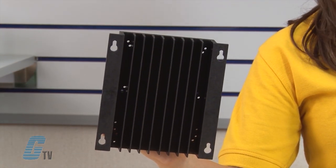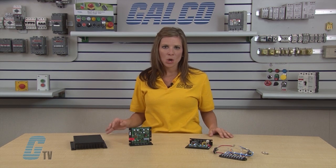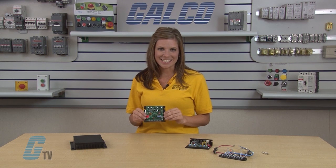Additional versatility is achieved by using the auxiliary heat sink, which is used to double the horsepower rating of each model. The output of the control is a linear function of potentiometer rotation. Motors that require larger amounts of horsepower would also require the heat sink accessory to prevent the drive from overheating. The drive can simply be fastened to the heat sink by lining up these holes here to the openings on the side of the drive and tightening the screws.